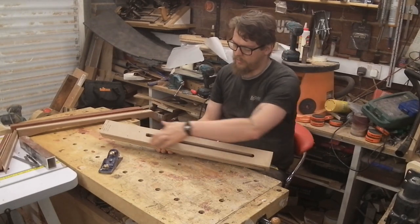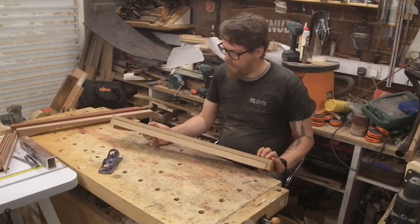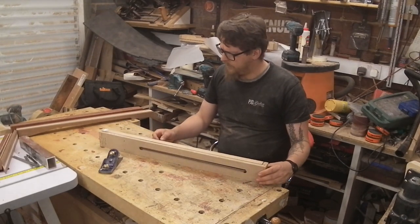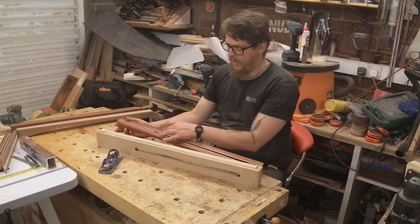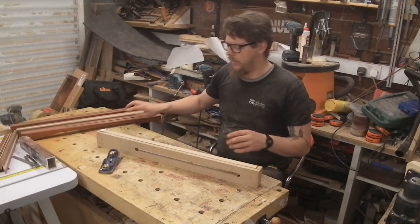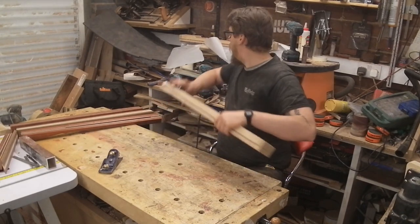And in that, I've cut a channel that the collar fits in and runs along. So that stops at both ends, and it fits perfectly for a, I think it was a 460mm truss rod. So all three of these have now got slots cut which match up with the truss rods. I still need to open up the end here for the nut of the truss rod, but we'll do that a little bit later. What I want to do is get ready to put the ears on for the headstocks, because I'm going to be doing this bit by hand anyway, so it doesn't need to fit into these cradle jigs anymore.